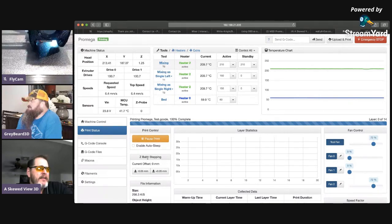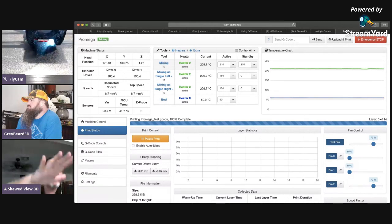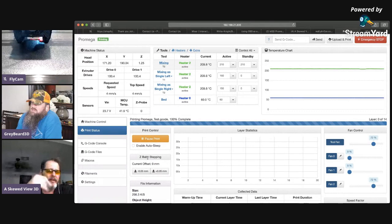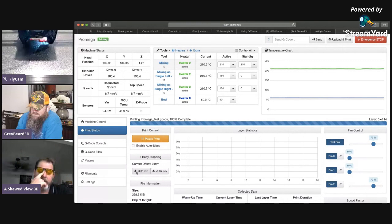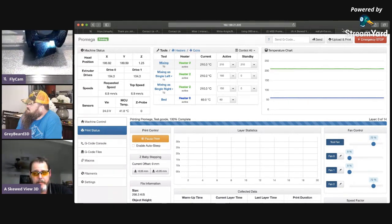Okay. Well, earlier you said the bed was going down with the plus. Now you're running a negative. You did say that because you called me an idiot for not knowing that. The bed goes down with a plus. I want to lift the bed so I get more squish. You're right. My bad. So yeah, I would go at least a plus 10. At least to start, anyhow.